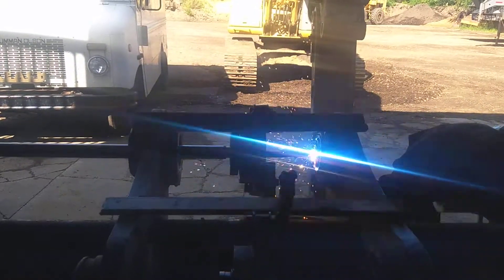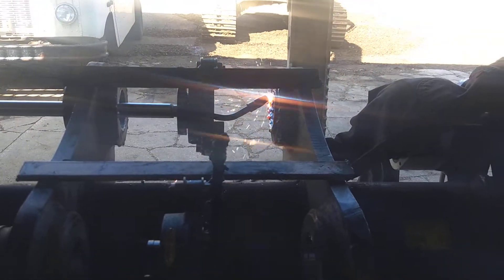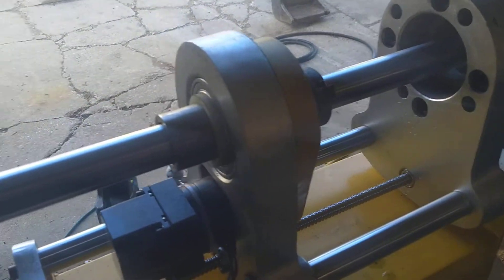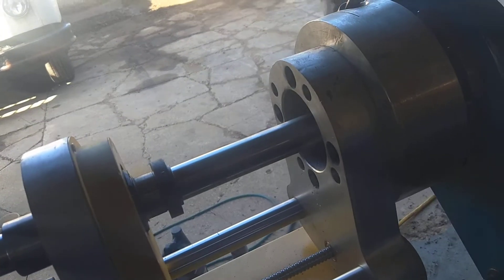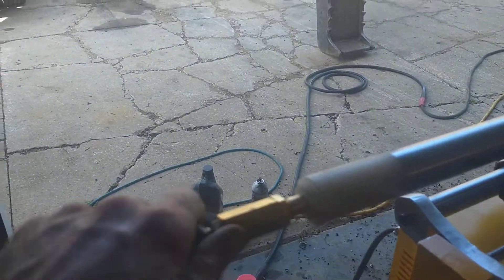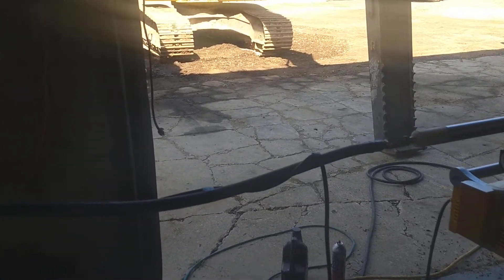You've got to be really careful about how you set everything up. There's a lot of play in these slides and some play in this bearing. So you've got to be careful how the load is, because otherwise as you're moving it can drop over center and all of a sudden your distance from your bore changes. Whatever they've got in here for a swivel is kind of catchy, and if you let the cable just hang on that, it winds up and then comes loose with a big bang.